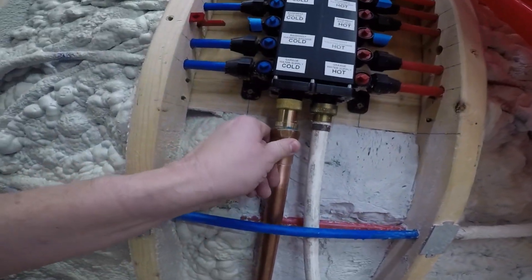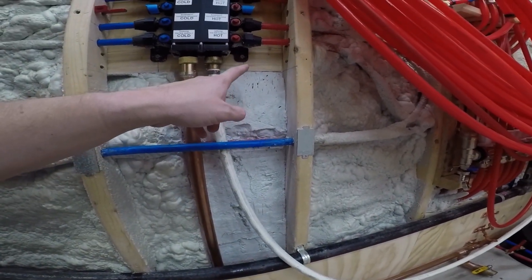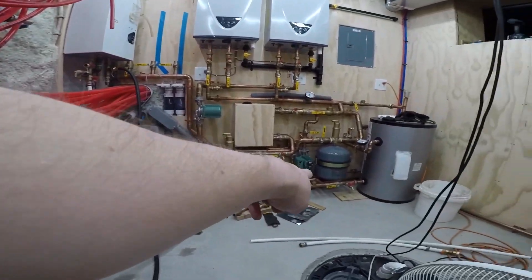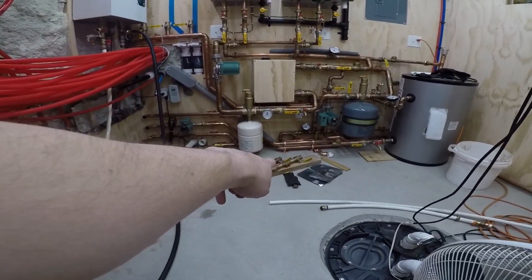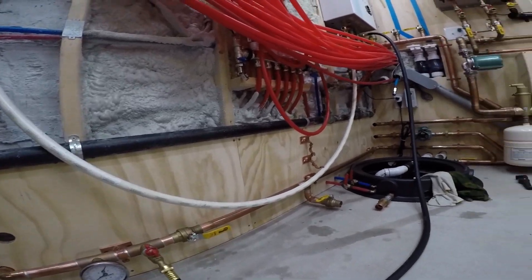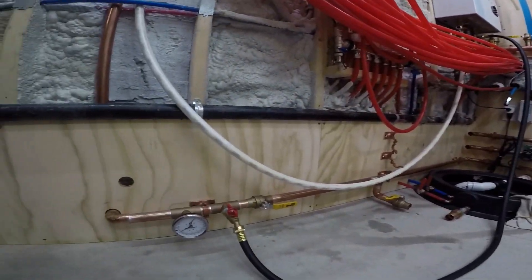This one will be next — the hot will come down, go through there, come in here and turn, then either go up or down. This is actually the recirculation loop, so it'll go through the recirculation pump and back into the check valve and back into the hot water tank, just circulating. I've already built two identical manifolds here — one here, one here — and they'll all get the same treatment: shutoff and gauge. All that soldering work — I'm not a plumber — so it was really exciting to turn this on and not have water blowing out of joints. Thanks for watching.